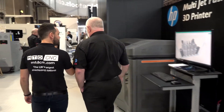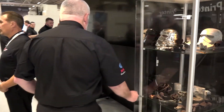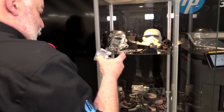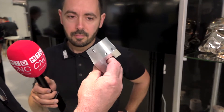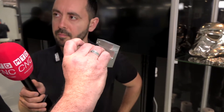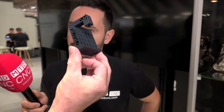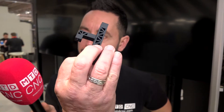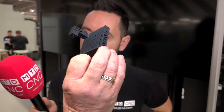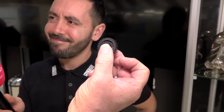If we take a walk over here — one of the things we look at for design and practicality: if you look at these two parts, that part there is originally from a prototype machine — it's a standard machined piece of aluminium with locating pins and holes. What they do now is print this; it actually goes into every machine. If you can get that on camera — it's topology optimised, there's only material where you need it, it's only as strong as it has to be. And those gears there are printed for these machines, on these machines.